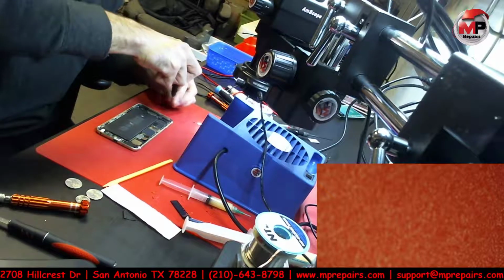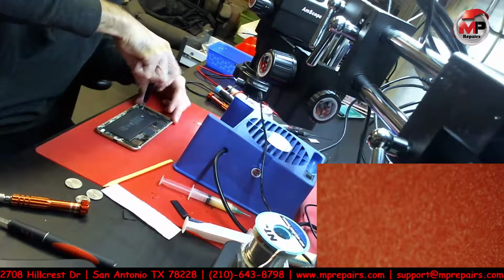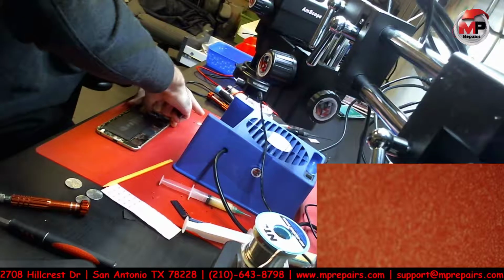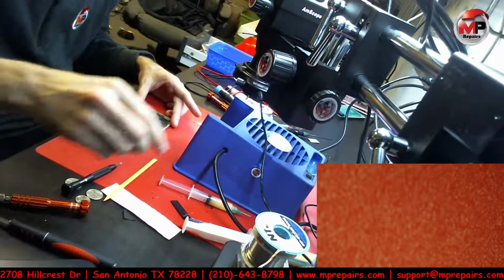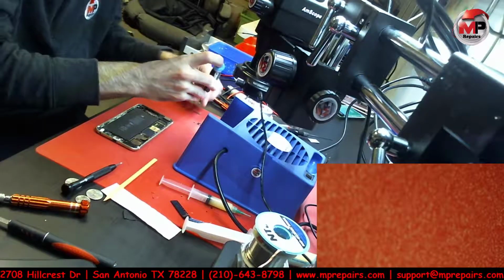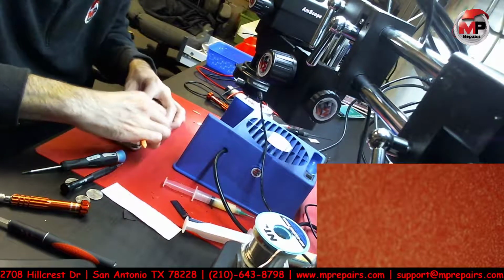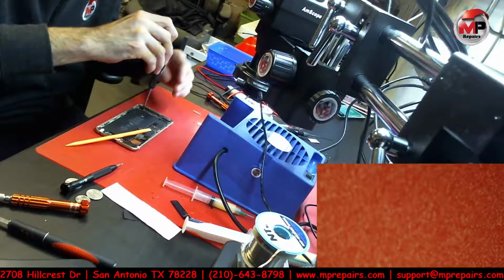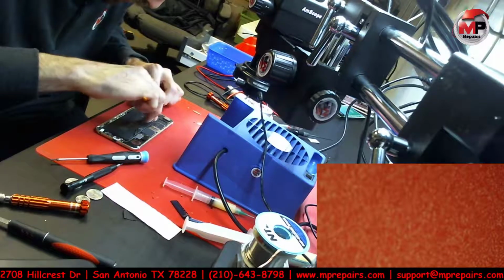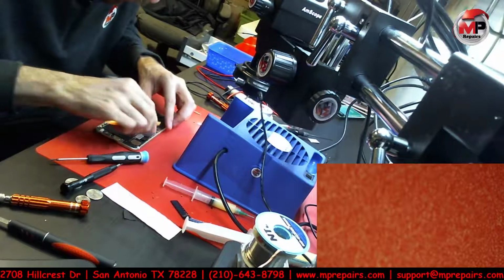So if you have a 6S Plus, you're pretty much safe from this disease, as they call it, touch disease. If you're not familiar with it, just Google iPhone 6 Plus touch disease, and you'll be able to find everything about it, which is not much, honestly. It's simply a flaw in the design, where you happen to bend your phone, and there's an IC chip that ends up bending and losing contact with the board, and in most cases, it actually rips the pad off the motherboard. So as you flex the board, you'll see that it goes and comes back because you're making that connection on and off. So that's pretty much what happens.